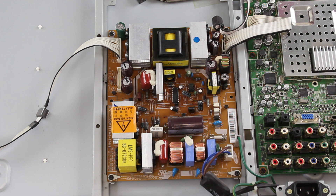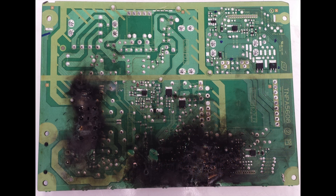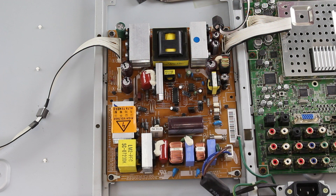Removing and installing new components requires the ability to solder. When looking for damaged components or burn marks, you can also look at the bottom side of the board. You would simply need to disconnect all the cables and then remove the screws that hold the board to the panel. Be sure to take a picture of what the board looks like in the original state with all the cables connected, so you have a reference for when you reconnect all the cables.